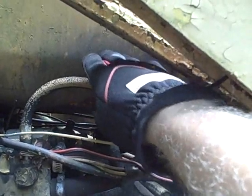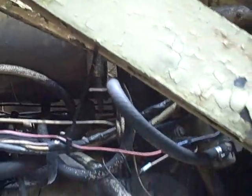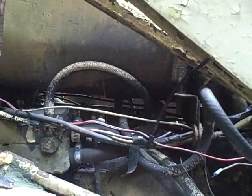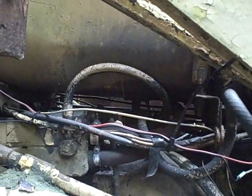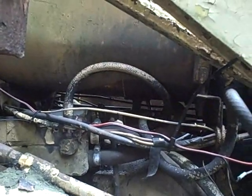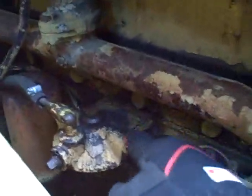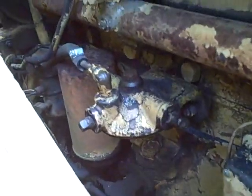This is actually at about here on the tank. So I could see once the fuel level dropped down to here, gravity feed into that filter would not work. So that's probably why they were having trouble running it when they were running it low on fuel. But that's at least the theory I would subscribe to. And that bracket's stock, so it's kind of interesting that that's like that.